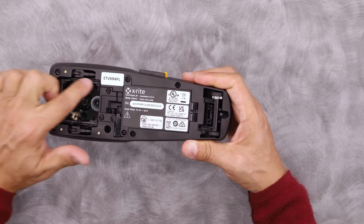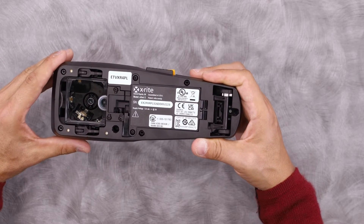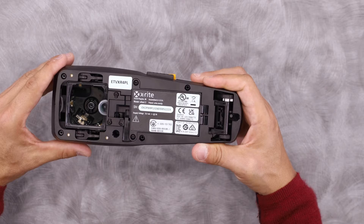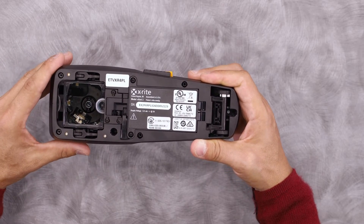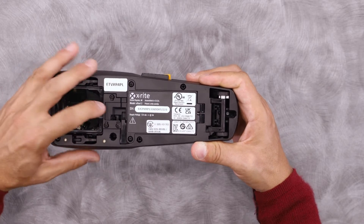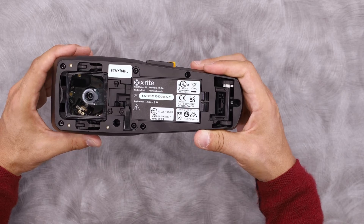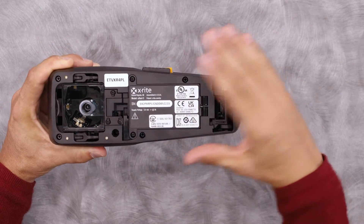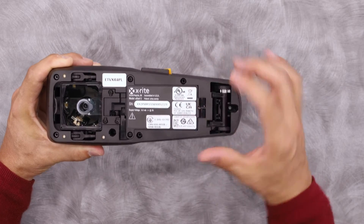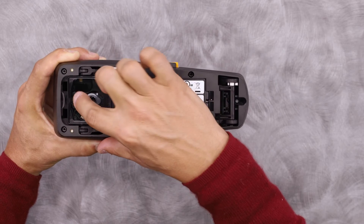You'll also notice this recessed area in here. This separates the aperture from the substrate, in case you're measuring wet ink, drawdown, or other dirty materials, where you don't want to contaminate the aperture on your instrument. Also built in here is a media flattener for film, foil, and flexible materials. This holds those materials down so you can get a flat surface when taking a measurement. This special frosted coating in here can be easily cleaned and is non-abrasive, so you don't damage your substrate.